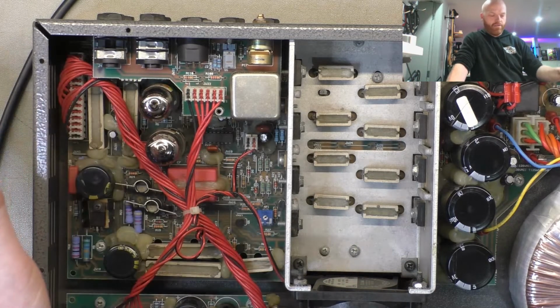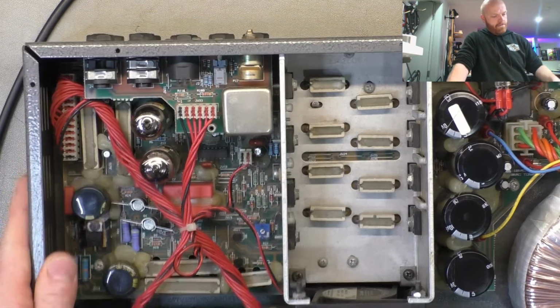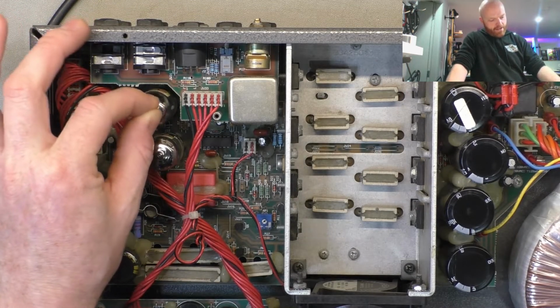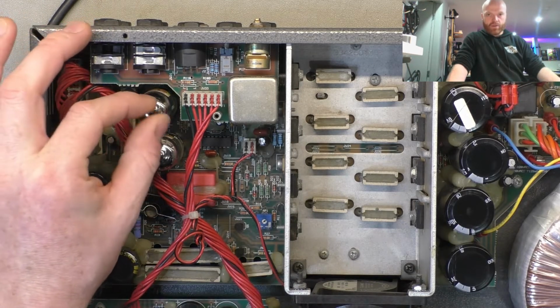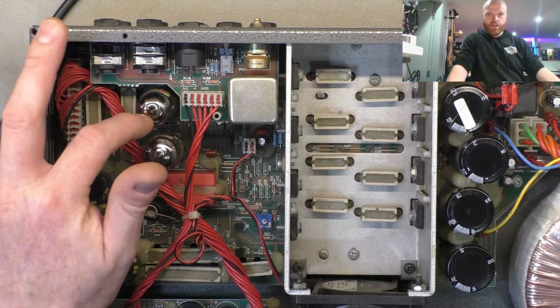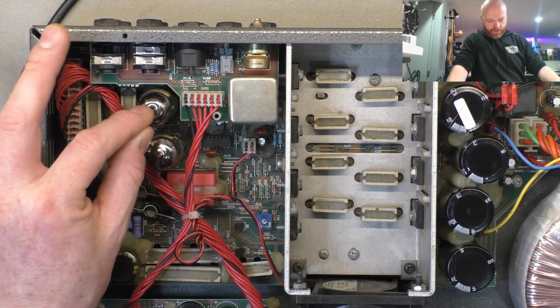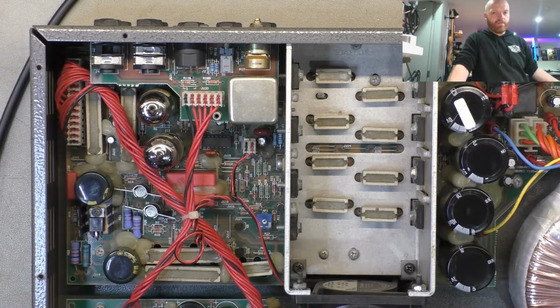Granted, your signal can't get through, but your fan relies on the integrity of the connection to the heaters and the valves. It's a bit questionable design practice there, but anyway. So that crackling we're hearing and the fan changing its speed or cutting out, that was the voltage going through the heaters being intermittent. So that could be from the valve pins being dirty or the connection to the circuit board underneath. So I would be pretty confident that we should probably pull this circuit board and have a look at the bottom side of it.